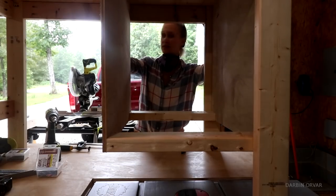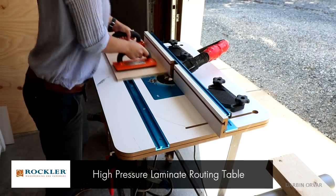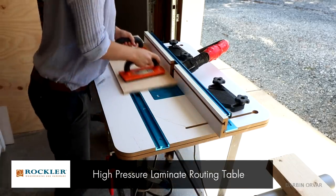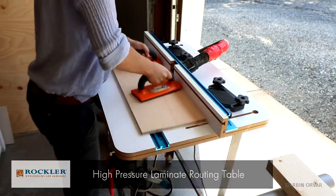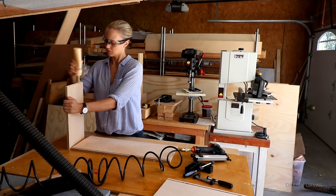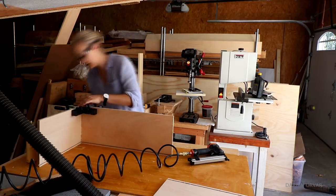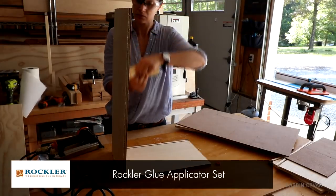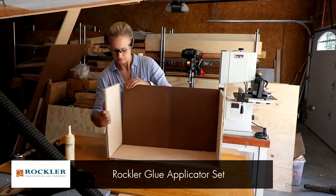The sides are done and the basic structure is done, so I have drawers left and some edge banding. I'm using half inch plywood for the drawers, routing a groove for the bottom and using backer board for that part. Going basic with the drawers - using a pin nailer and glue to connect it together, which is plenty strong in my experience. I just love this technique; it works great and there's no fuss involved.